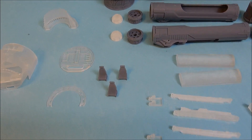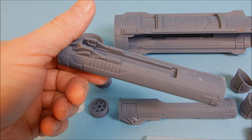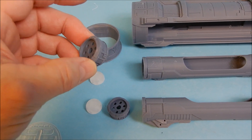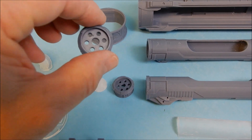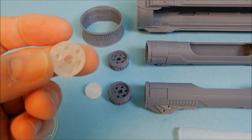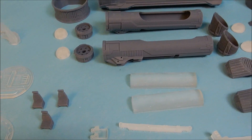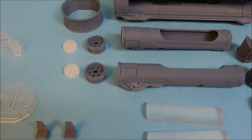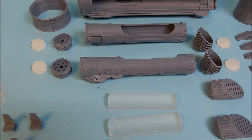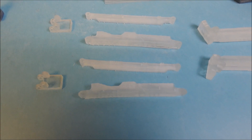The engines, as you can see, he made hollow so you can light them. He put little hinges on here, and over here you have the little front dome pieces. It's set up to use three millimeter LEDs. What I'm going to do is buy some blinking three millimeter LEDs — they'll all blink on their own, not set up to a pattern. They'll blink randomly, because the blinkers start off at the same time but some are a little slower and faster and then they become very random looking.